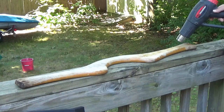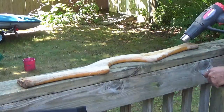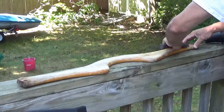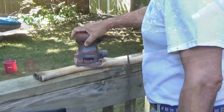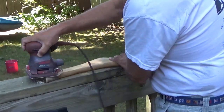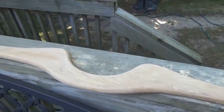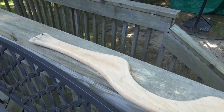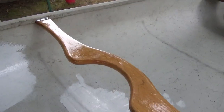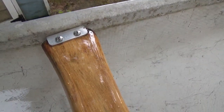Taking a heat gun and a scraper to the old varnish. I'm going to add some wood to the few bracket angles that go over the top and the end of the thwart to reinforce it, and I've got some white paint on the inside of the repairs.